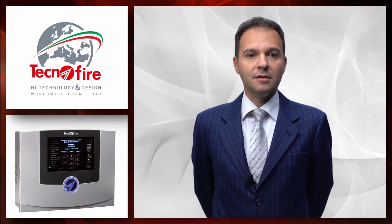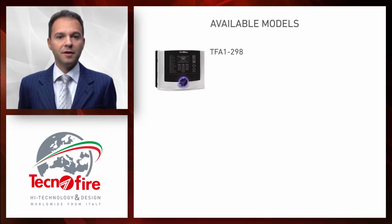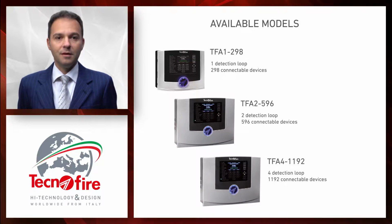In this video tutorial, we will introduce the Tecnofire control panels by TechnoAlarm. Three are the available models: TF-A1 298, TF-A2 596, and TF-A4 1192. TF-A1 control panel has one detection loop allowing to connect up to 298 devices. The TF-A2 control panel has two detection loops allowing to connect up to 596 devices. And the TF-A4 control panel has 4 loops allowing to connect up to 1192 devices.